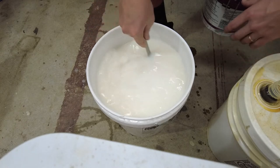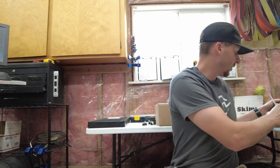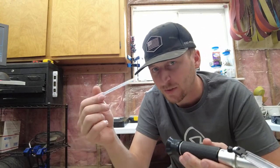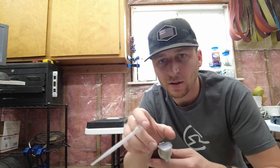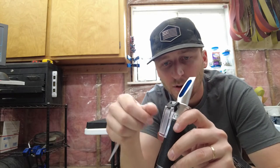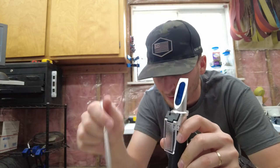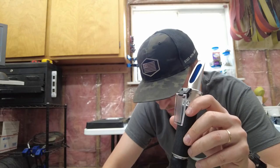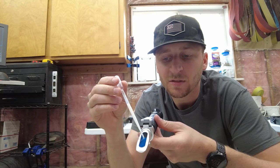They say oil and water doesn't mix — why coolant mixes, I don't know. That's a question for a chemist. For the refractometer: you just have to make sure you buy one that has the right percentage range. Take your pipette with your coolant, put a couple drops right there on that blue surface — just a tiny amount. When you flip this over, it spreads it out. And then if you hold it where that blue surface is towards a light and look through it, it's crazy — crystal clear, it shows a level across there.